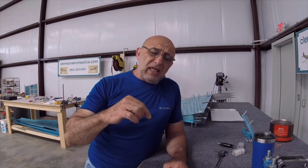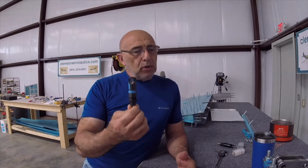But what I do have to worry about is in occasions like the horizontal stabilizer, the spars, I had to make some kind of fixtures from wood to hold it in a position where the surface of the material that I am countersinking is directly flat with earth, and we can go down with the tool, and it's easy after that. Once it's set up, once you make some kind of a fixture to hold it, it's a done deal. Just don't go too deep, because you cannot undo that. So it's best if you go shallow and then adjust it just a little bit at a time.